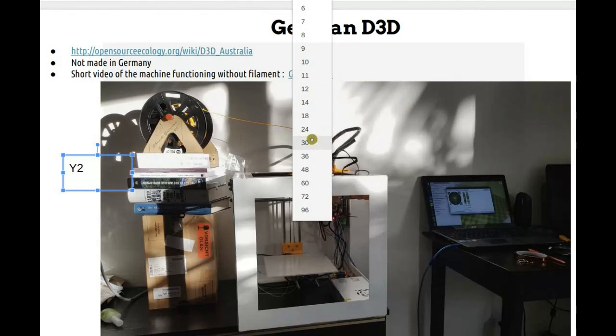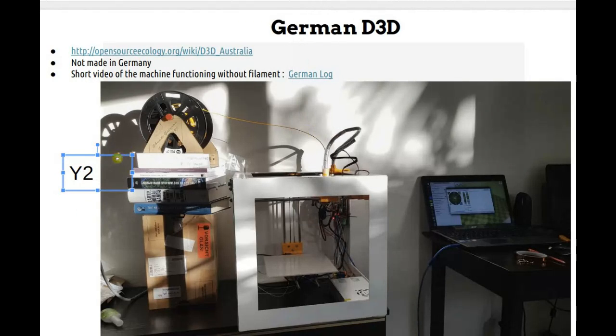And that is because of the location of where the bed is, correct? That is because of the location of, I think it was the end stop, or, no, I don't remember now because this was a couple of weeks ago that I came to this resolution. I have also modified the end stops to achieve the 8 inches on both axes X and Y. Those modifications are basically just extensions that I attached with super glue. It doesn't look great, but it's very functional.